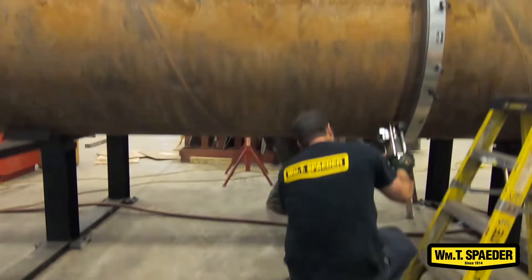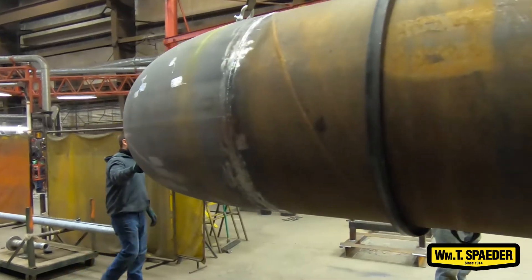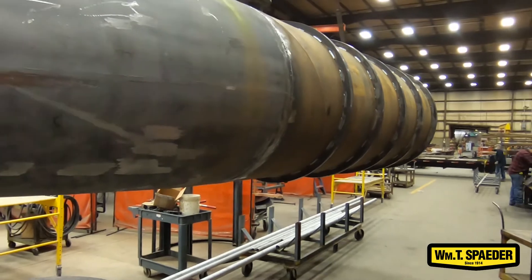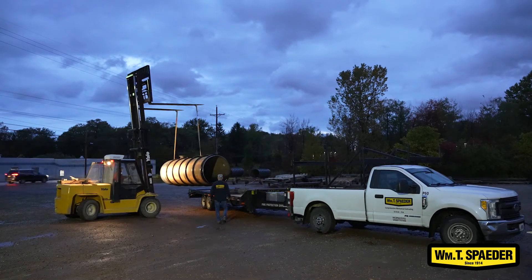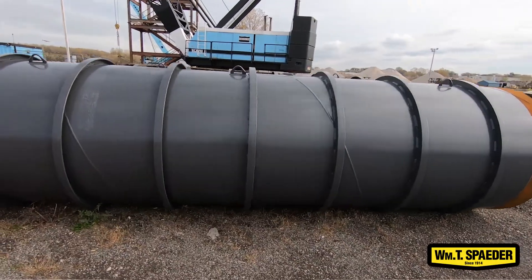The fabrication of the 48-inch and 20-inch pipe was mostly done in the fab shop. We came out here and took field measurements, field verified everything, and then sent it into our shop where they rolled it on the manipulators, loaded all the stiffener rings on, and all the angles and anchor points. The painting of the pipe was done with the same paint they use on the ships here at Don John Shipyard to prevent corrosion and keep the pipe in good shape as long as possible.